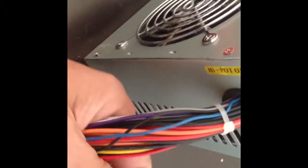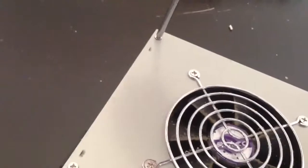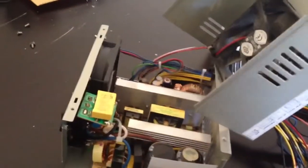Today I'm going to talk to you about how to take an old computer power supply and make a useful power supply. Here's an Antec power supply that I took out of an old broken down PC. I'm taking off the case and you'll see there are multiple multicolored leads inside. The only useful leads you really need are the black, the yellow, the green, and one of the red wires — everything else you can cut out.